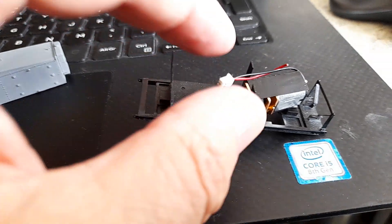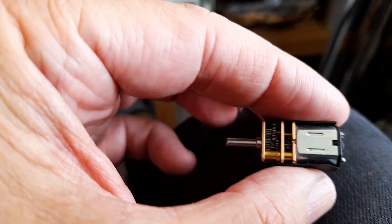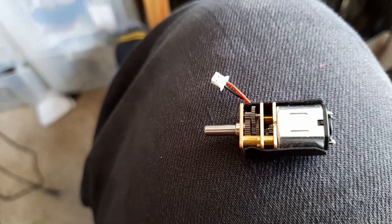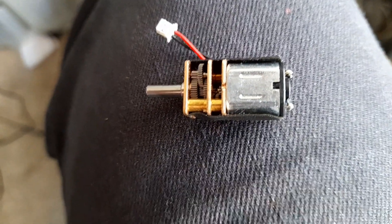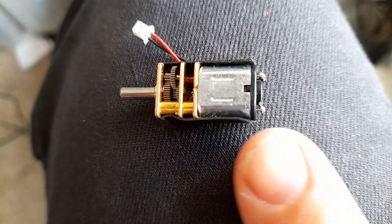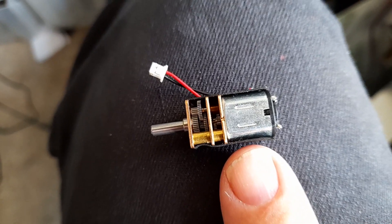I lift the body off. This little thing — here we go — is an N10 gear motor. Now it's exactly the same sort of gearbox and very similar motor. However, the motor is shorter. You'd think it would be 10mm shorter — the difference between N10 and N20 — but it's not. It seems only to be about 5mm shorter. Let me get an N20 to put beside it.